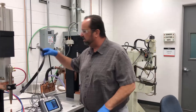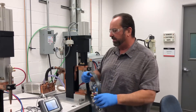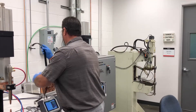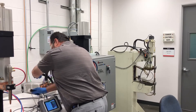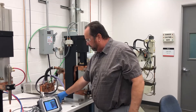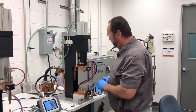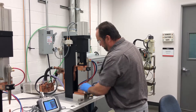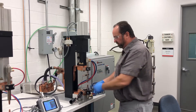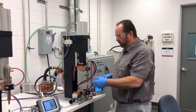Let's show you how to connect the toroidal coil and voltage clips. This is a large 800-millimeter coil — we have smaller ones around 400 millimeter range. We wrap it around any part of the secondary bus, since current is the same in a series circuit. Then we take our voltage clips and mount them right across the workpiece — clipping here and here. That measures the voltage drop right across the electrodes and the part where we want to see it.